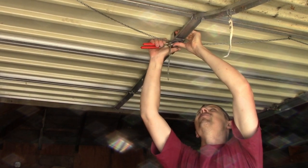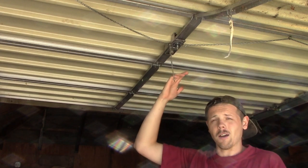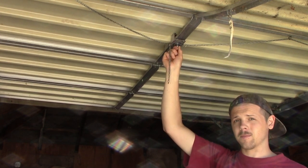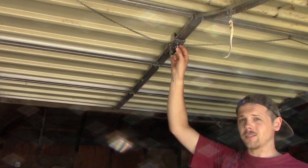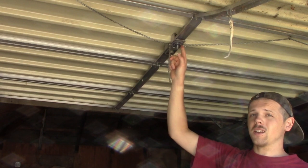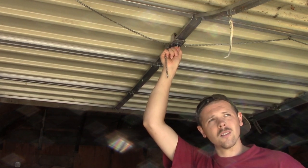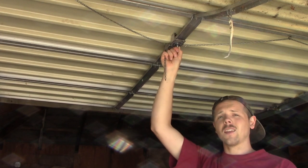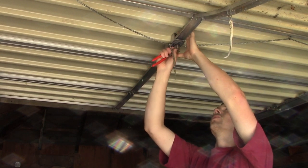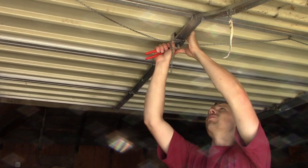Basically you can just keep pushing it up until it's relatively snug. Now what this does, in addition to making sure the handle doesn't just fall out, is that if somebody were to come along and take those two screws out, this is still holding it in place. You could use it without this, but then to break into your garage all somebody has to do is take out the two screws and twist the whole handle — because the lock doesn't keep this from twisting from the back end, it keeps it from twisting from the front end where the screws are. But they can't take the screws out if it's locked because then the handle's in the way. So that's how it works. Alright, let's wiggle this on a little more — I like that, looks good to me.